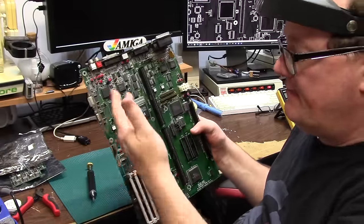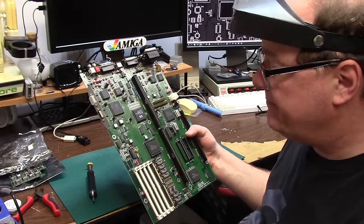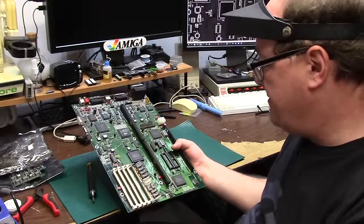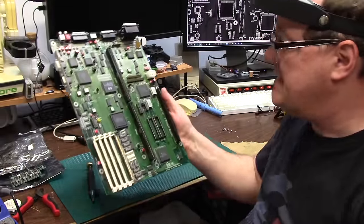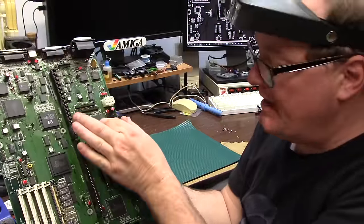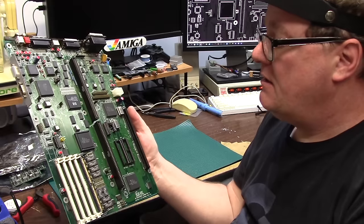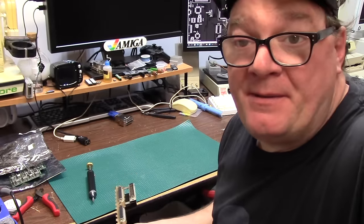You know, 177, 175, 176, or 975, 976. Great. No problems. Nothing's wrong with it, visually. But there's something wrong somewhere, because I'm not getting a CPU signal or ROM lines, and it's hard to trace these things when a CPU's in it, because it covers up the ROMs. So I'm going to try and use the 3630. It's really narrow. Jump right to internal, and go from there. And my carpet's really dirty, so I'll check back in a bit.